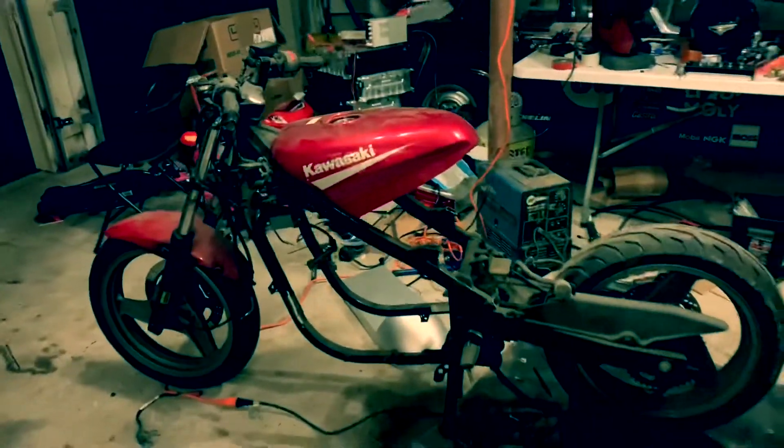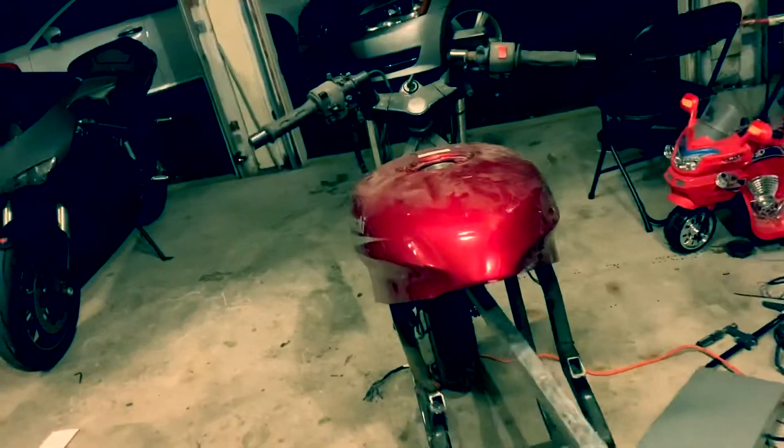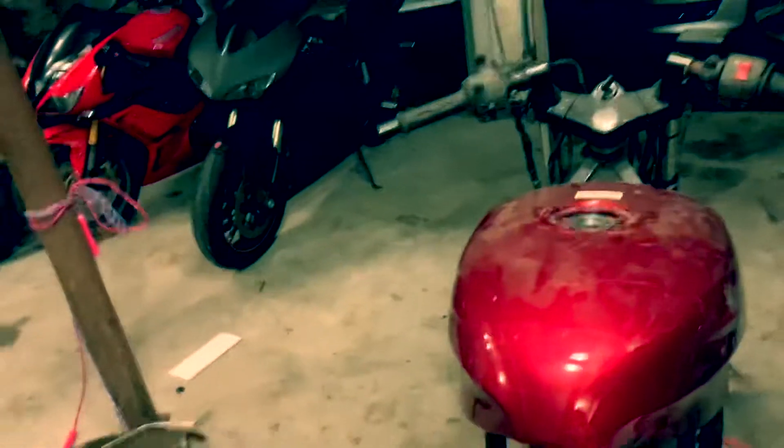So this is what I've got so far. Cut the tank in half. I'm going to have to brace this up. Cut the rear end off. Got a one-inch square tube. Put it up here for support - get an idea of what I'm trying to go for here.